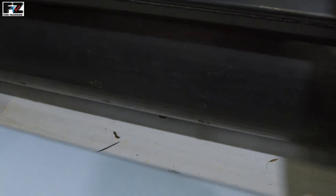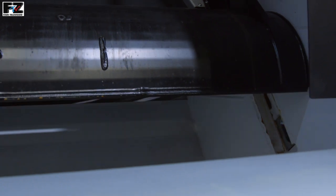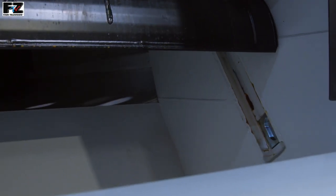The tail section of the hopper has a large volume of up to 3.3 cubic metres with a cycle time of under 21 seconds. To increase longevity and reduce hopper wear, the cheeks and the floors are made of AR400 wear resistant steel. As standard, the floor is 8mm thick and the cheeks are 5mm thick. As an option, we can order a long life pack to increase these dimensions.